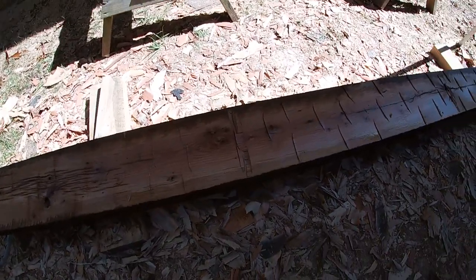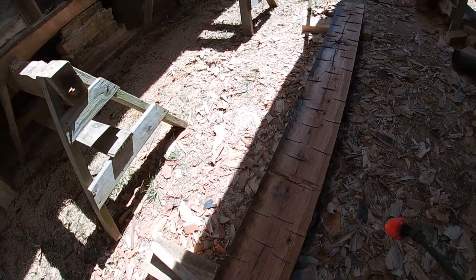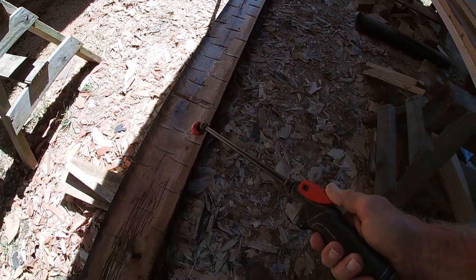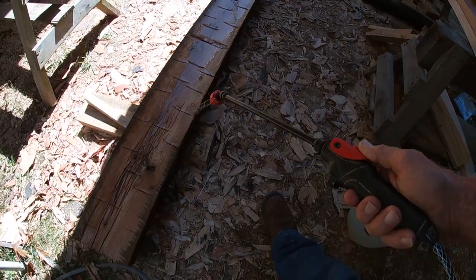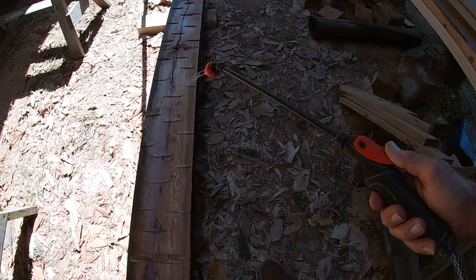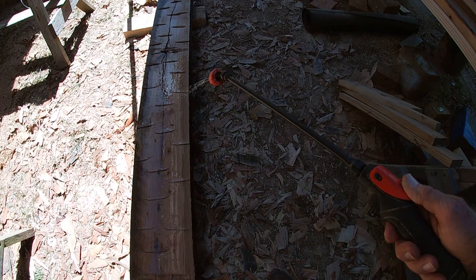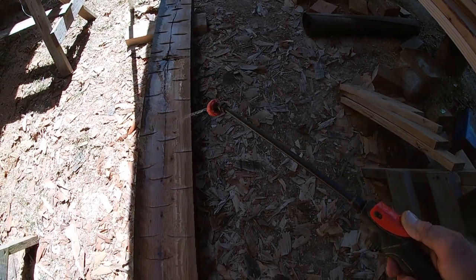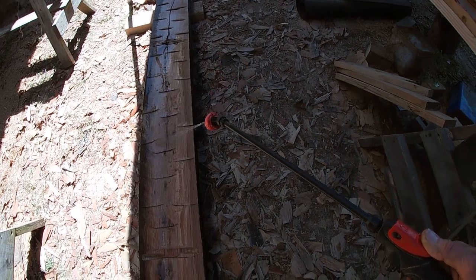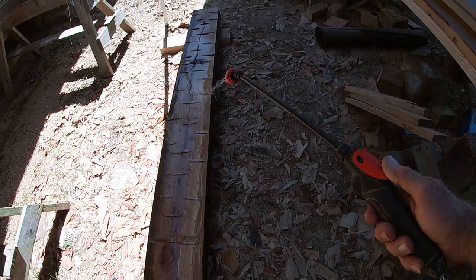I've used a garden sprayer, just a 3-gallon pump-up sprayer, and I just spray these logs with water to try to soften that wood just a little bit, because these are, like I say, pretty well seasoned. There's not going to be much shrinkage ever take place in these, I don't think. But to be able to hew these, it's so much easier if that wood's just a little bit softer than what it is right now. So I just take a little sprayer and soak it down real good. May do that two or three times. And then I'll hew it with the foot adz.